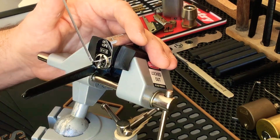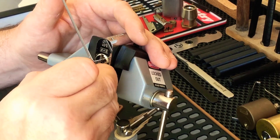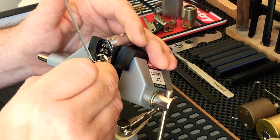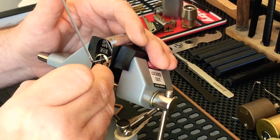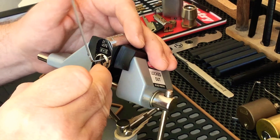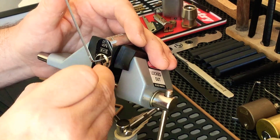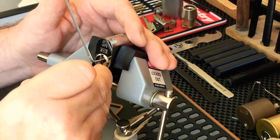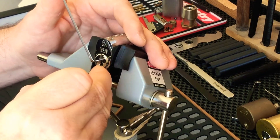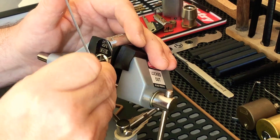It is picking differently. The pins I pulled out had a 2.8mm diameter, but the pins I put back in were lab pins — 3mm — so I had to cut some material off them and measure them up so they would land in the core. Just touched five and got movement.